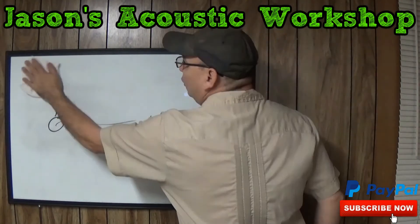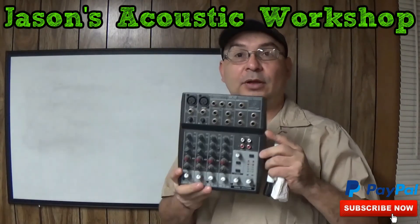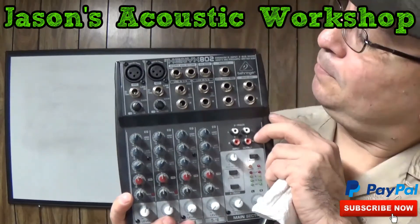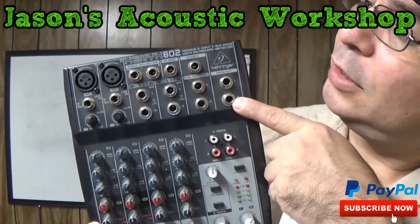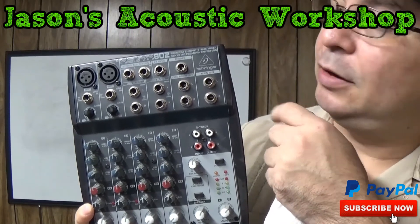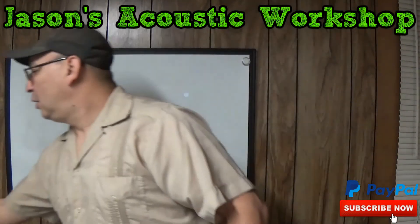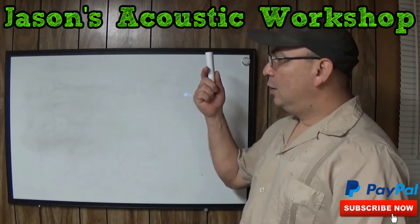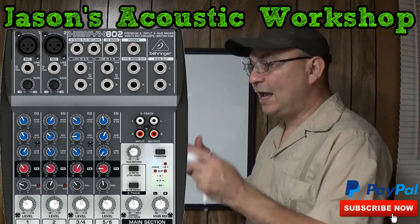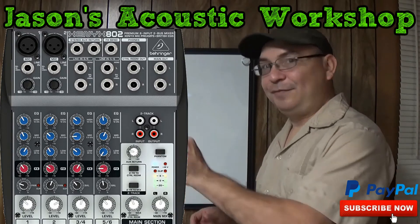If you don't want to go the mixer amp route, that's fine. They also have stuff like this — just a mixing board. And as you can see right here, it says main out. That's where you put your wires in to go to your powered speakers, because it's just sending a signal. There's no electrical energy going through those lines — just a weak signal. You can get a mixer amp that has auxiliary outs, or you can get just a regular mixing board with auxiliary outs, whichever brand you want. Because there's no amplifier in those plain mixing boards, you have to supply the power — and that's when the powered speakers come in handy.